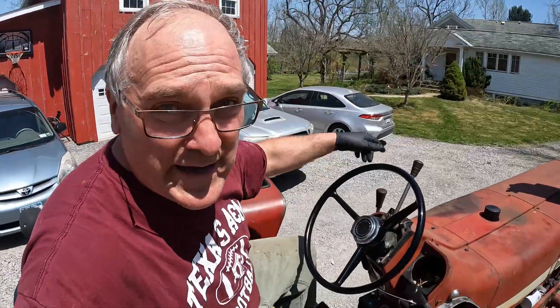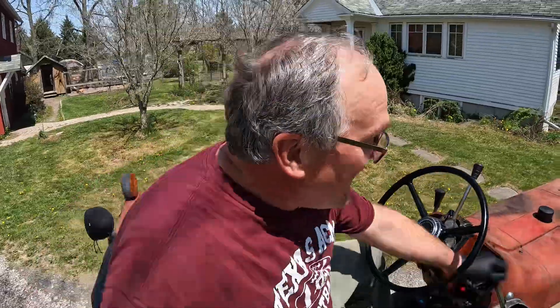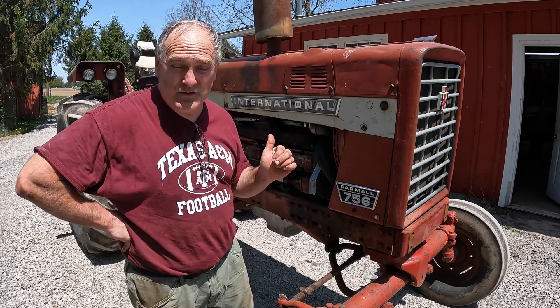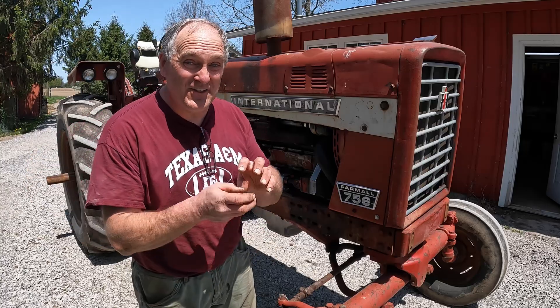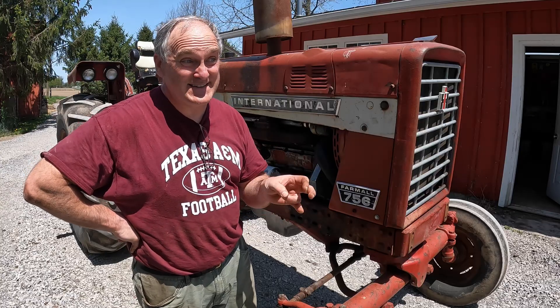One other thing I wanted to mention is the torque amplifier — use it. Shift it quick just like I did. Don't baby it, use it. It needs to be running low side as much as high side. I have never had a problem with a torque amplifier because I use them. So we got this old girl shifting like a champ — so much better than before. I suspect the transmission brake is pretty worn out and will need replacement sometime in the future. But other than that, this was a smooth process. Thank you so much, Farmall Doctor — so much easier than the manual adjustments. If you have an 06, 56, 66, or I think 86 tractor, this process applies to all of them. I hope this is helpful — have a great day and I'll see you next time.